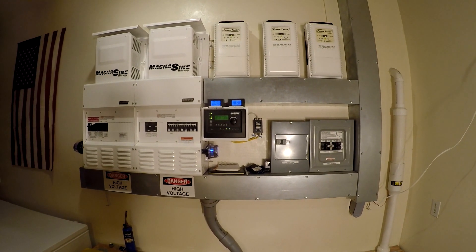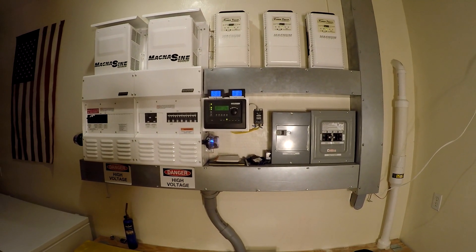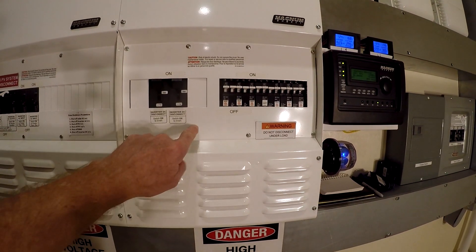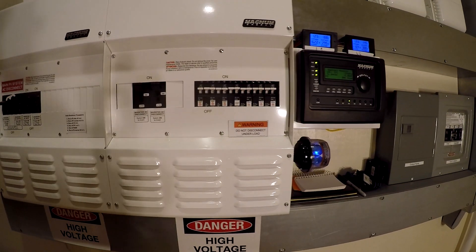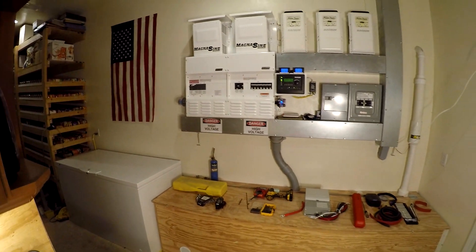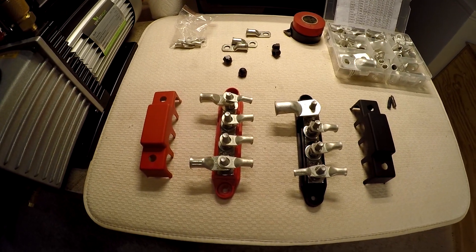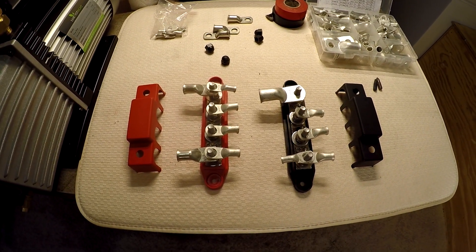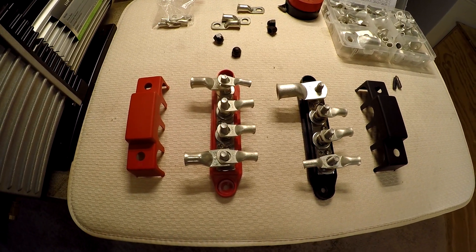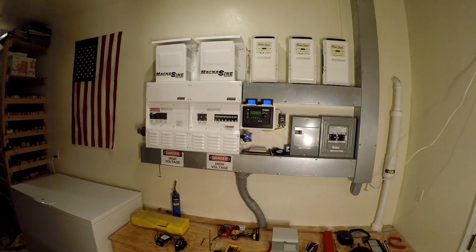Hey guys, so today I'm working on a solar power project. I added 5,000 watts to this system about eight months ago, and that brought it up to 13,000 watts total. There's a wire in here that all that power has to go through, and also the bus bars in there that I think are a little undersized. So it hasn't really been a problem, but I just want to get in there and beef it up. So I'm going to add these bigger bus bars, add all these copper tin copper lugs, crimp them all up, and double up on the wiring. Just going to make it stronger — so it's a little open heart surgery project.